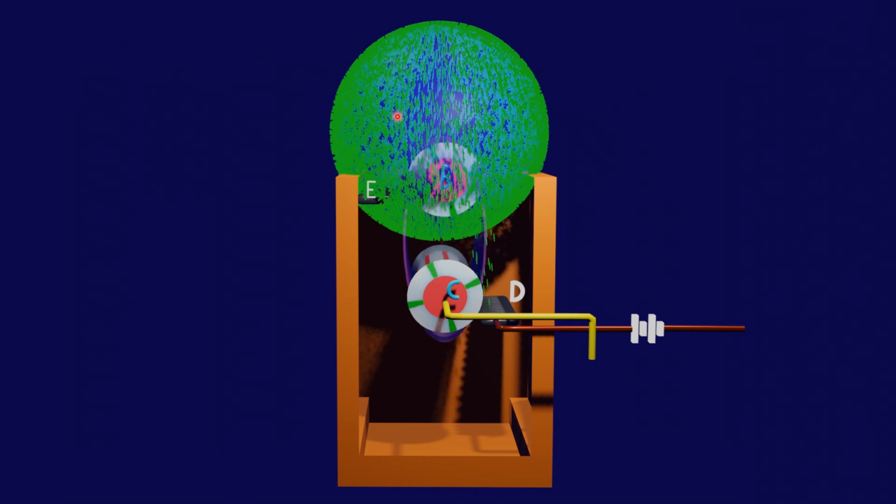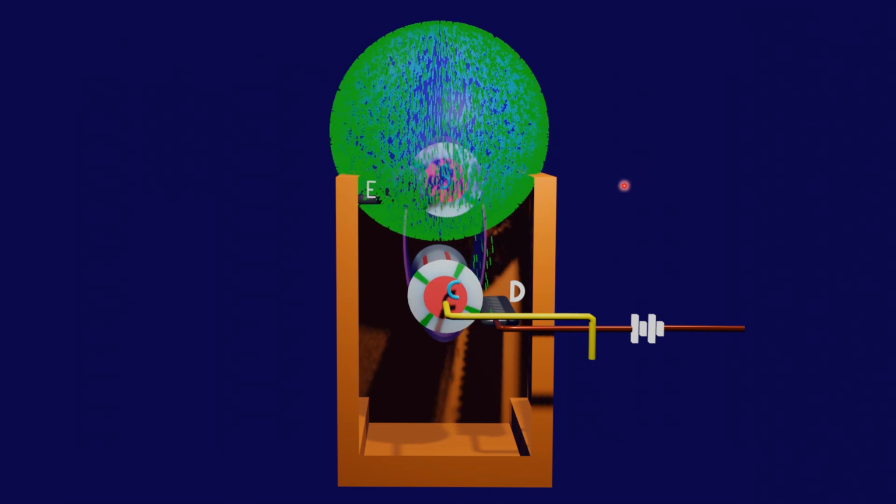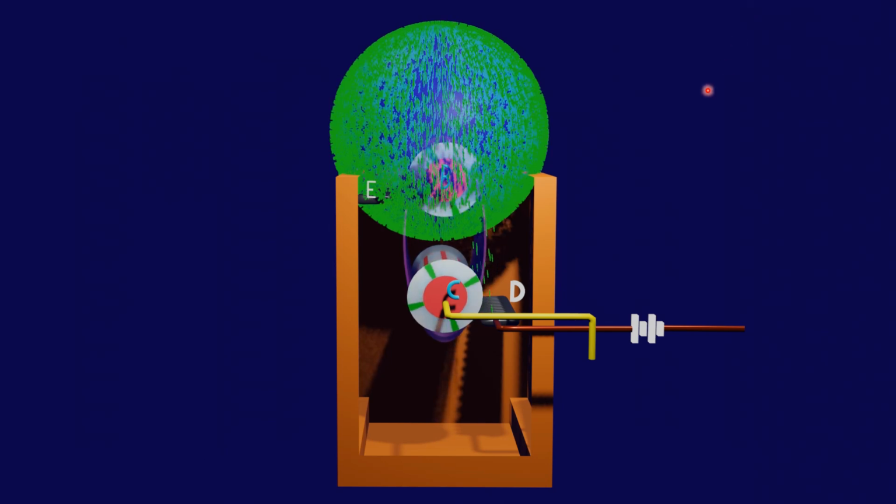This process continues until the outer surface produces the potential difference of the order of 10^7 volt, which is the limiting value. We cannot store charges beyond this limit, that is 10^7 volt, since the extra charge starts leaking to the surrounding due to ionization of air. The leakage of charges can be reduced by enclosing the machine in a gas-filled steel chamber at very high pressure.